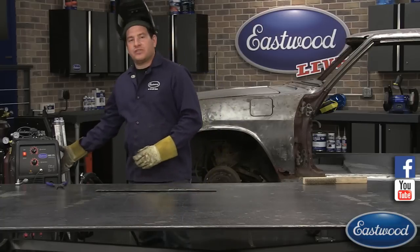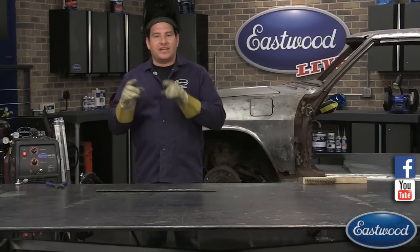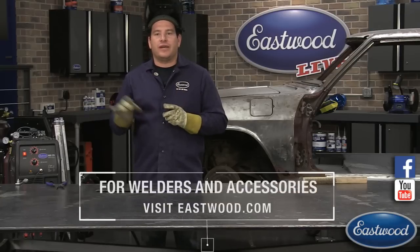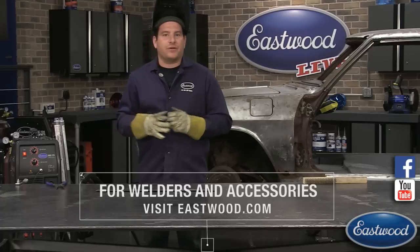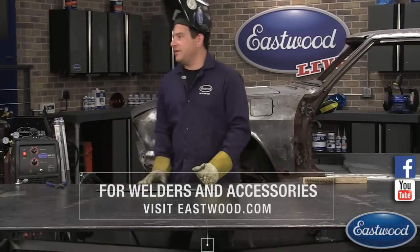Our welders at least have a little chart in here that gives you an idea of the thickness of the metal that you're welding and the wire and the settings, so you can get an idea of what's acceptable. If you look at our chart for an 023, it's probably going to be marked off, or you're going to have the welder cranked at a funny setting to weld a thicker gauge. So just keep an extra spool of wire on your cart so that you can swap them out pretty easily. That's a good question, though.